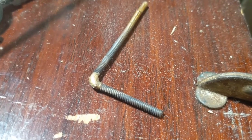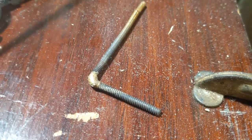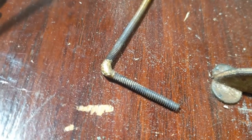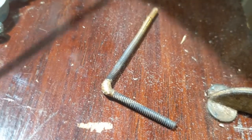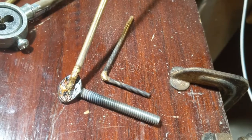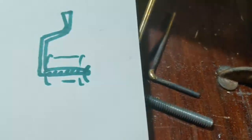You can try to anneal it first and that might help to relax the metal — taking it up to temperature and relaxing those molecules just to make that bend. I didn't have my torch around initially, but ended up having to use it anyway to go in and braze those two ends of my threaded rod together. While I was at it, I took the next gauge thickness up of that rod and brazed it to the flat head of a bolt.